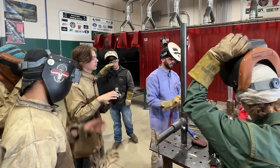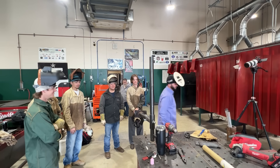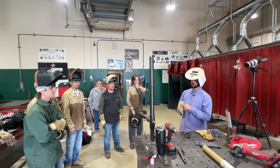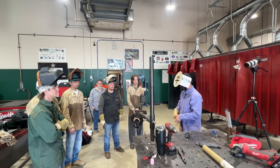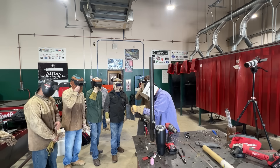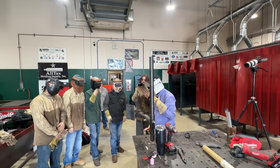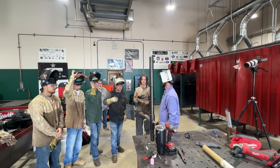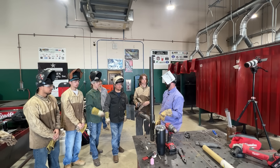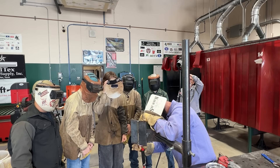Now we've got our fit piece. I know where the gap was a little wider so I want that to be my top. In a timed competition you don't need to call for your buddy to help tack it — we're going to turn the machine up to 200 amps and just tack it with the torch, no filler metal, using the tack that was already there. It's super quick — happens fast at 200 amps. Crucial part: don't forget to turn your machine back down to 125. Here we go — let's put a root in.